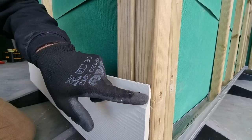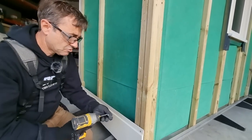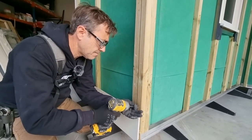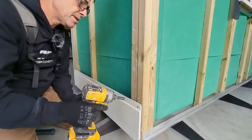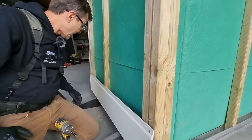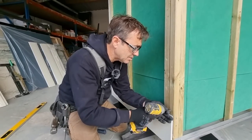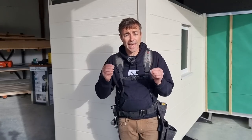What we're looking for is a nice parallel screw. What we don't want to do is screw at an angle, because you can see it will increase the depth of the screw and you will experience trouble putting that lovely tongue and groove detail together. That is a definite no-no.